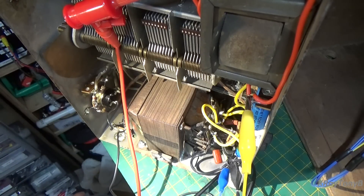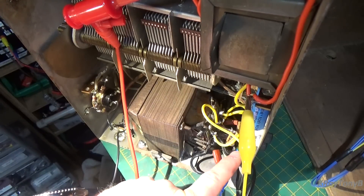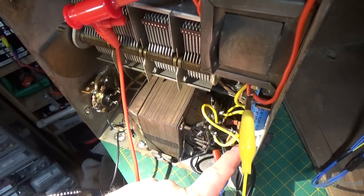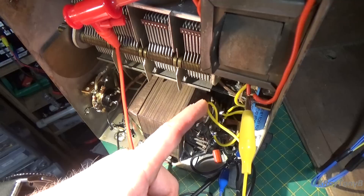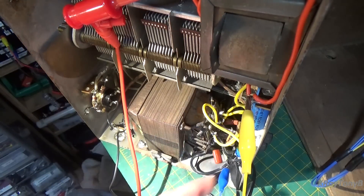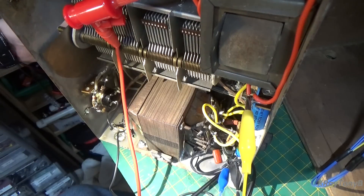So where are we? Lots of changes. The first thing I did was install the dropping resistor, and I installed these two 250-volt, 10-microfarad capacitors in series. That gives us a 5-microfarad at 500-volt capacitor right at the output of the transformer. So even if that creeps up to 400, 450, or even a little higher, we've got plenty of leeway in this capacitor to handle it.